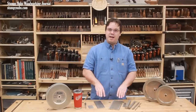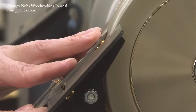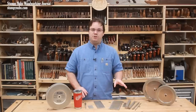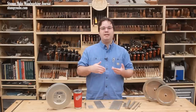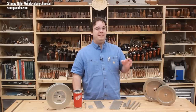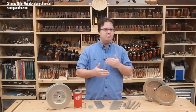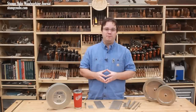Because when you're sharpening by hand, you aren't producing much heat at all. But when you really speed things up at the grinder, you generate lots of heat. At those temperatures, the steel will absorb carbon from the diamonds, creating a chemical reaction that forms graphite and weakens the diamond abrasive. That's why you don't see that many diamond-coated wheels marketed for bench grinders. At high speeds and temperatures, they would just wear out quickly unless you're really careful.